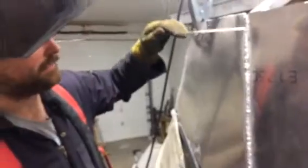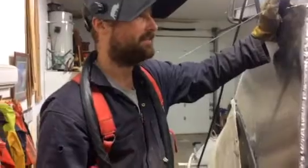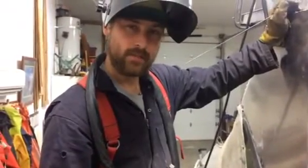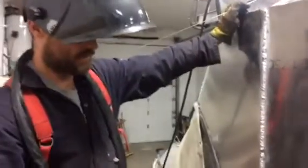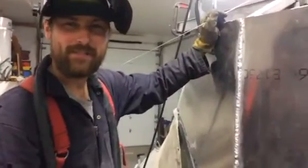The keys are: being really comfortable — ABC, Always Be Comfortable — clean, clean, clean. You want to clean the aluminum as well as you can; a stainless steel brush is what you're looking for. Then take your time and find your rhythm. It takes a lot of practice. Sometimes I have a nice weld like that, sometimes I have a terrible crap weld. It's a learning process. Part of my learning is going to be visible on the outside of my boat, so you can make fun of me if you see me around town, but it's a great way to learn and it's a lot of fun. If you can get good at this, you can get all kinds of work — there are a lot of people that need aluminum welders. Hopefully you guys will ask any questions you can think of. It takes a lot of hours, but it's better than watching TV. We'll see you guys later. Peace.